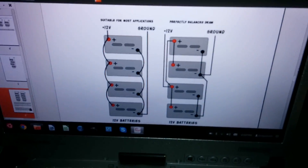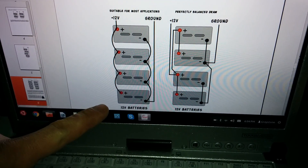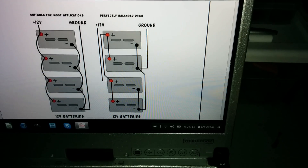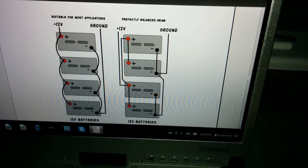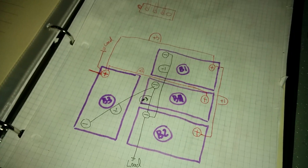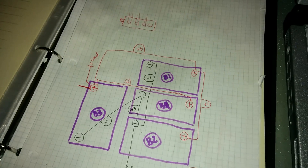I'm going to come over here — we have this design right here. It could be wired up this way; it looks a little bit more simplistic, but it's not really what I'm looking for because I'm putting a lot of load on this, charging and discharging. So we're using this balance draw method here, and my battery design is slightly different than this battery design, which is why we get something that looks more like this — my simple little schematic I drew up. Same exact wiring, different battery design.